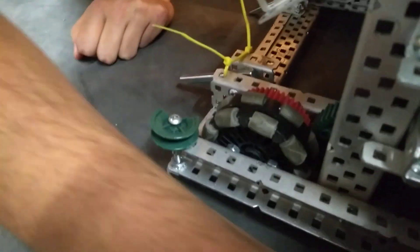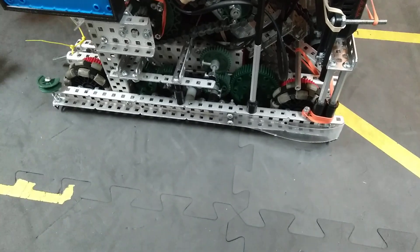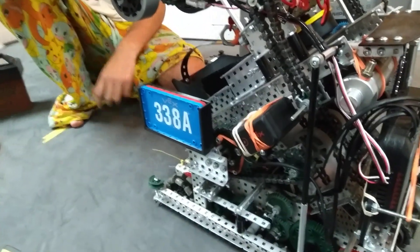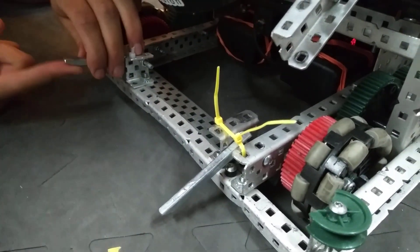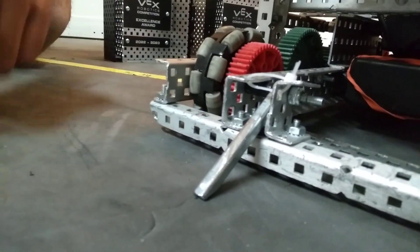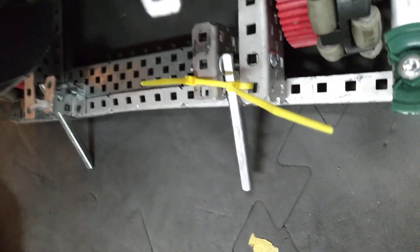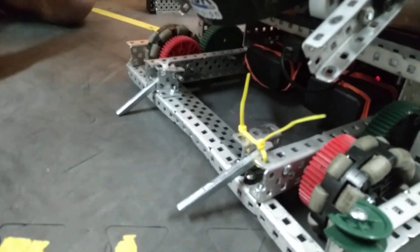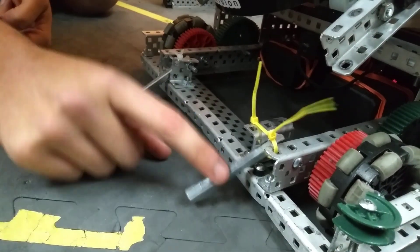This strap here basically helps line up on the wall and keeps you from scuffing into it too hard — I always see someone just dig in real hard. This is really good for skills. For wedges, same as how most people do them: we take a high-strength axle, mill down the ends at an angle, drill through them, put a screw through it, and attach it. Our ram bars are pretty beat up — that's its job. We had to put zip ties on these, because eventually they'd be touching the ground and refs would be mad since we hang over the line for auto. The zip ties keep them from inverting, because if they invert it stops you from driving forward.